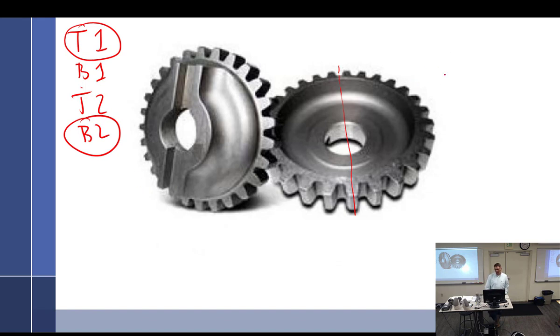We had a freshly overhauled engine. I had nothing to do with this. And the customer called and said, I just feel like this engine should be producing more power than it's producing. It's a fresh engine. It just feels a little weak. Yeah, we'll bring it on in. We'll take a look at it. So he brought it in, and it was a C85 engine. They had a C85-12 and a C85-8. And the 12 had a starter, and the 8s did not. Well, it wasn't that they just left the starter off. They put a different kind of accessory case on the back, and the way the magneto was driven was different. So on the C85-12s, I don't remember if it was left-hand rotating mags, and the Dash 8 had right-hand rotating mags.